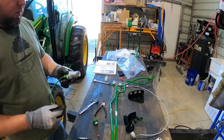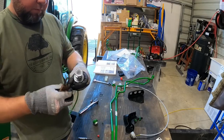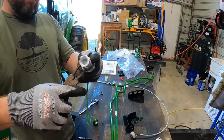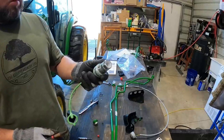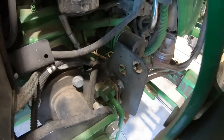So the valve is installed at that point, and there are two factory wiring harnesses that plug into the valve that are already right there on the tractor. So these are the front couplers. It comes with couplers that have grooves cut in them for some snap rings. You only put the front snap ring in, and you're about to see why. It's because we're going to slide this coupler through the mounting hole right there that accommodates that. This is the mid mount of the tractor.